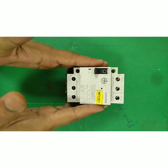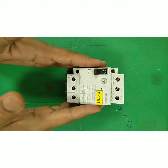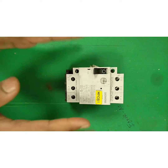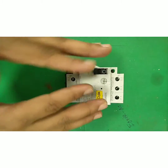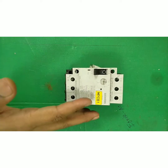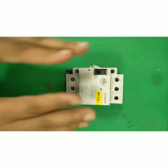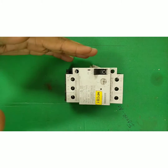This is additional or backup protection, you can say, to protect the motor. It is available in the range of 0.1 to 630 Amps. As per the requirement and application, you can use whatever rating is needed — it totally depends upon the motor rating or calculated current value. It does not have any range selection option for short circuit protection, because in a short circuit, the current will suddenly rise to 5 to 10 times more.